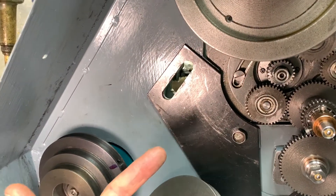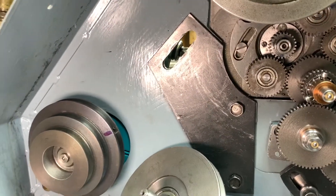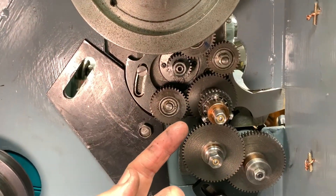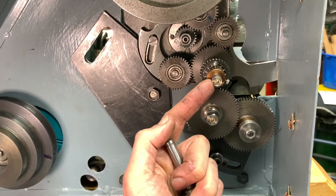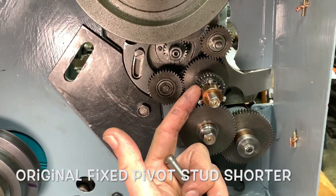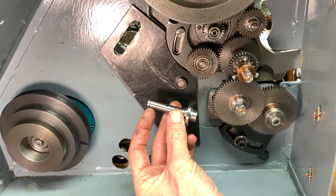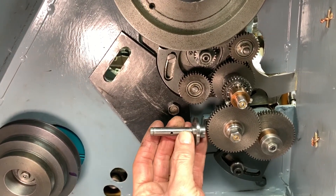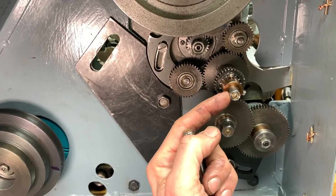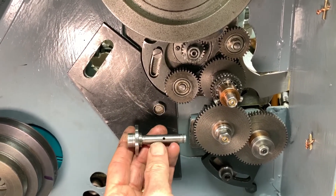The jockey wheel supporting plate has been cut back here to allow room for the tumble reverse plate to swing into. This is the new gear chain fixed stud — it's longer, with a little thrust bearing in there. The original gears were held on with a little C-clip. It was cross-drilled with an oiler on the end. The new one is cross-drilled with an oiler on the end as well, and we can return the machine to the original configuration if we want.